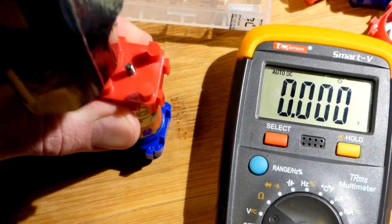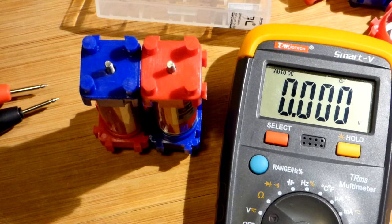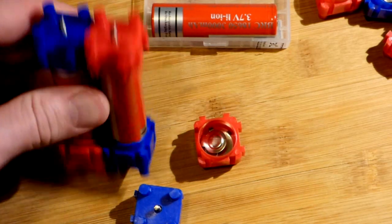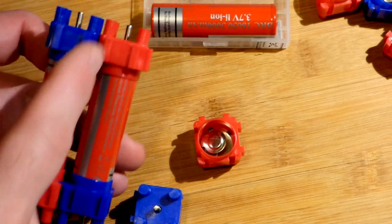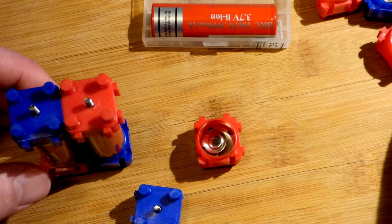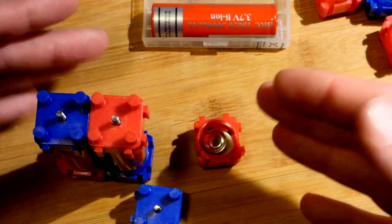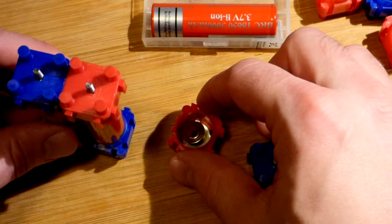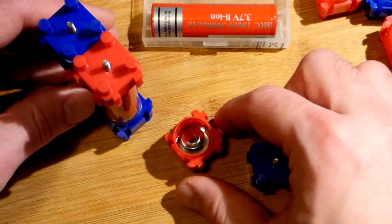You can make long strings of these and connect them together. Now if we want to add one in series, we have positive here and the negative side of this battery there. We can connect it on either end — let's leave one side floating, connect these two with the bus bars, which you just slide in and screw down. We can keep going in either direction, but first make sure the teeth line up.